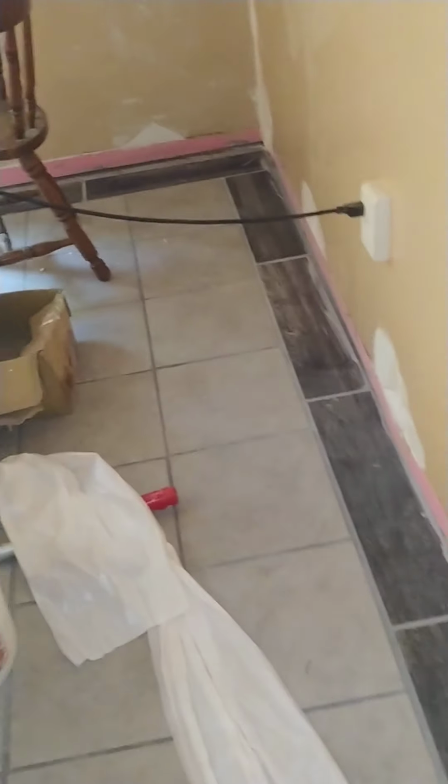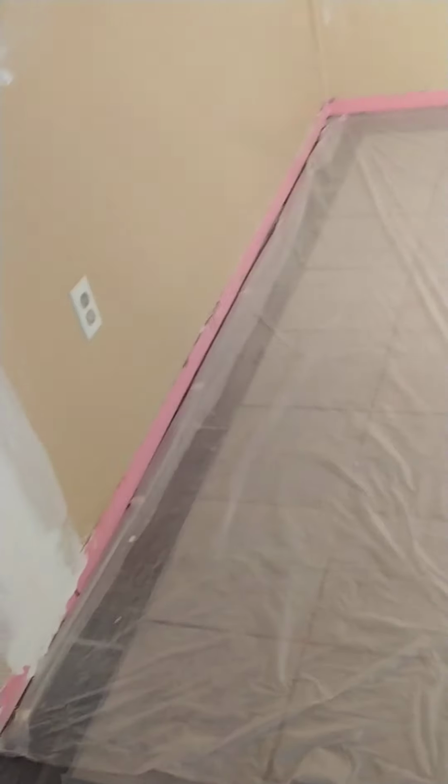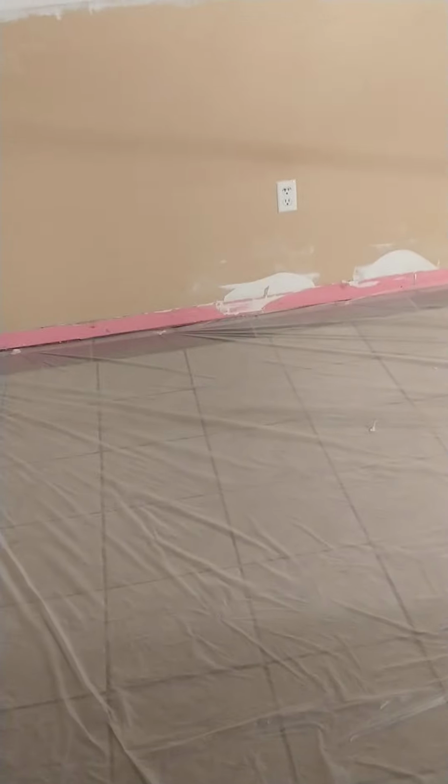As far as our tile stuff, basically 50-cent 12-inch tile, expensive border trim, and it makes a nice bordered room. So you can keep your costs down, but you can add some character to what you're doing. And then I'll use the gray tile as a base, 12-inch tiles divided in half, so that it'll become a 6-inch tall base going all the way around the room.